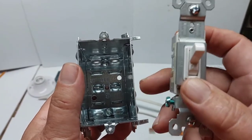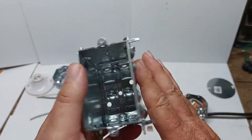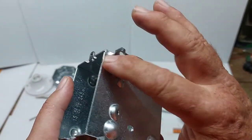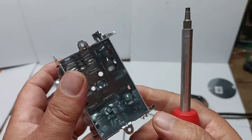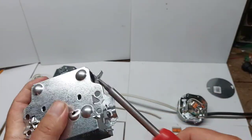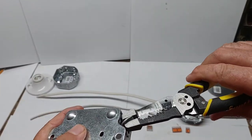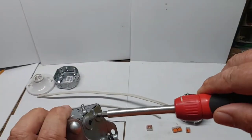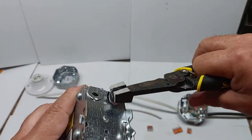We run power to the electrical box and switch first, then to the light. We'll prepare this electrical box — it's the type that fits on a two-by-four and has a space for your drywall. There are all kinds of different electrical boxes. We're going to take the knockout tabs out of the bottom so we can run the wires in — just bend the tab and it comes off easily. Do the same on the top for the wire running to the light.